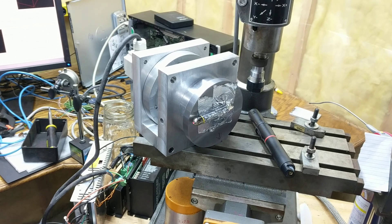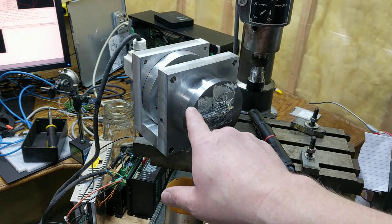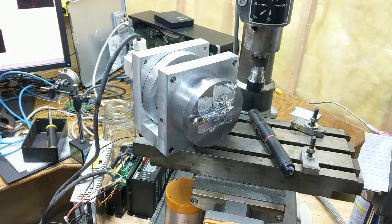Here's a slight update. I tightened up the wheel bearing — I took about three-ish thousandths off of one of the inside races so the preload was a little more. It took me two tries: I did about a thousandth and a half and it was still loose, then I did another thousandth and a half and now it has drag when you turn it, which I think is pretty good.